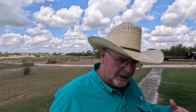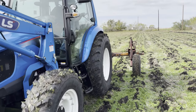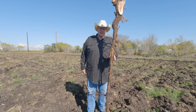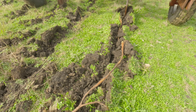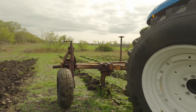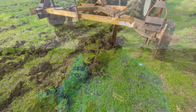After finishing that, I decided to go out and do a little subsoiling or ripping with it. The area I was ripping had a lot of mesquite root. In the very beginning, we weren't dropping it down deep because of the mesquite roots. Some people might say I wasn't dropping it very deep, but I was catching roots — if I dropped it too deep I wasn't going to go anywhere. So we were easing into it, grabbing roots and pulling them out of the ground. We ripped that place up really well, and I don't have hardly any mesquites in there anymore. The tractor took care of that very well.